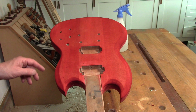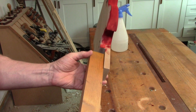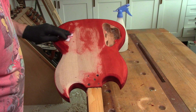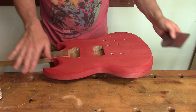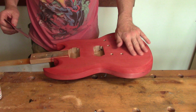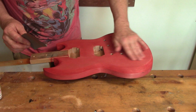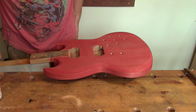What I've done is given it a quick coat with the stain and then used the damp tissue over the whole thing to even it out — it was a little blotchy at first but it's now much more even. I'm turning it over in the vice to do exactly the same on the back surface. After about 40 minutes drying, the grain has raised and it's no longer smooth, so I'm going over it gently with 600 wet and dry to knock the grain back down before putting on another coat.